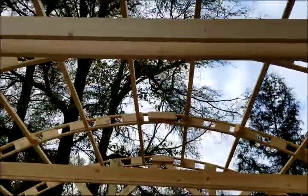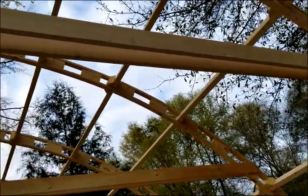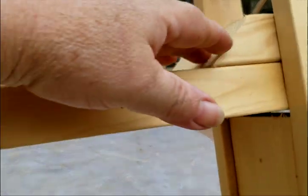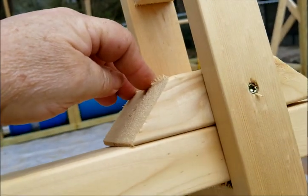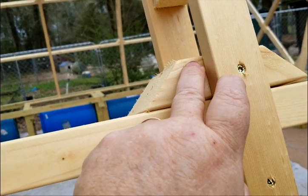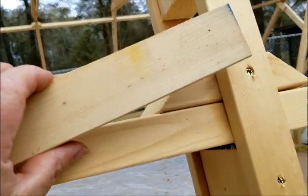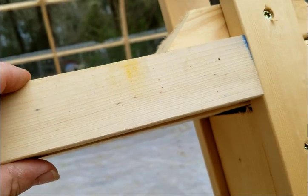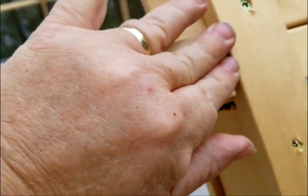What I need to do is in between these I'm going to put blocks, making them kind of a ladder bar going across this girder. My two-by-fours are attached, and where there are two going together they're actually toenailed in up top to give them a better bite — that way you're joining this to this and then from there to here. Before I put my sheets on, I'm going to take the three-quarter trim and glue it and use finishing nails to stake it on there, let it dry, so it'll be nice and flush going across for my sheets.